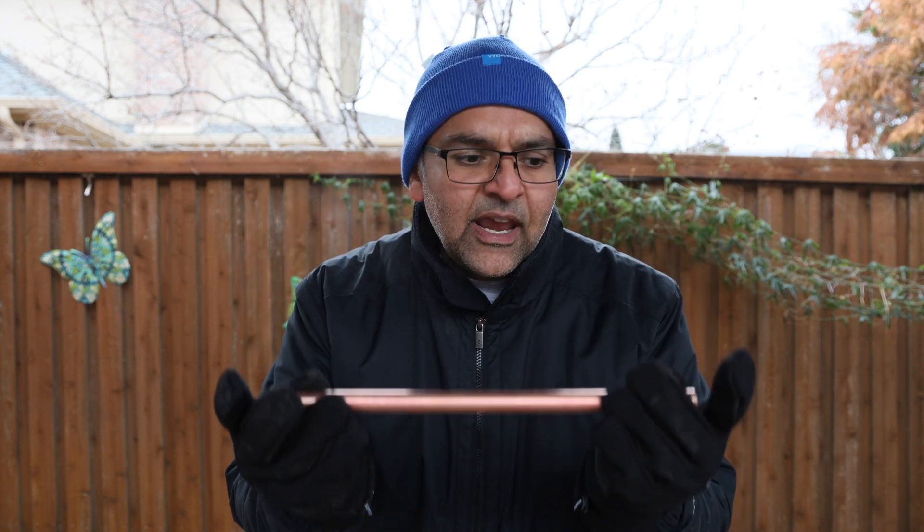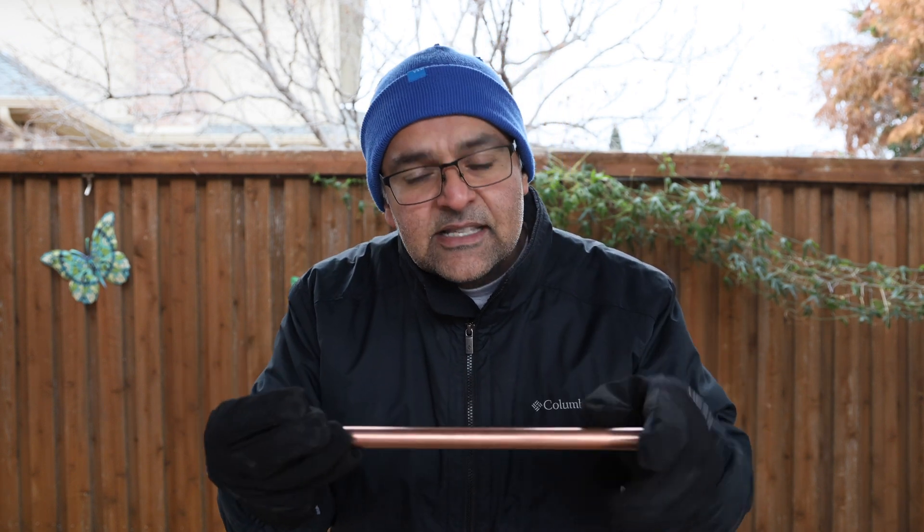There's not much information online, so I thought let's figure this out together. I've got some copper piping, PVC, and pex. These are common building materials in all of your homes that run your water. Here's the experiment: we'll fill a piece with water, cap both ends, and leave it outside in this freezing Texas winter weather. I'll have an identical piece with a tiny hole to simulate dripping your faucet. I'll have a thermometer out here on my outdoor patio and let's time lapse it and watch what happens.